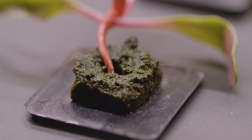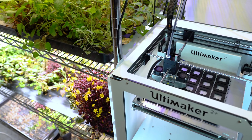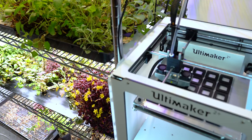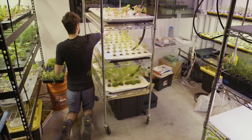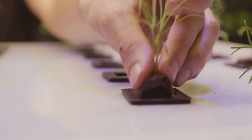Looking at just the plant pods in our system, we've probably printed at least 20 different designs. And looking beyond that to our LEDs, we prototyped the heat sinks for those — printing them out to see how they fit into our system, going through five iterations before we decided to get them made out of aluminum. That typically would not be realistic with any other production method.